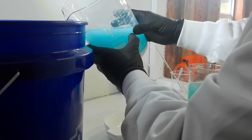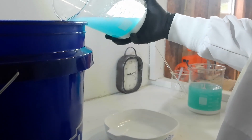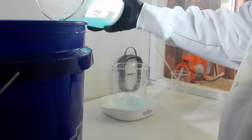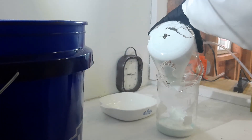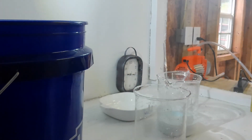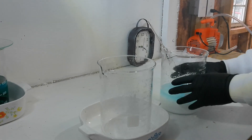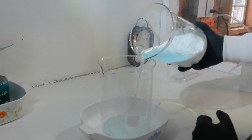Now we'll recombine these. At this point we'll do multiple rinses. This gets rid of all the copper nitrate and any other contaminants remaining, until all we're left with is distilled water and silver chloride. We know when this is done when the water is crystal clear and tests negative for copper.